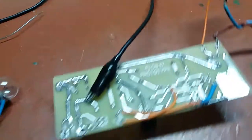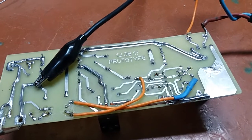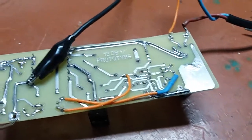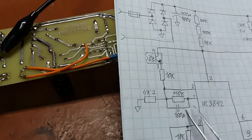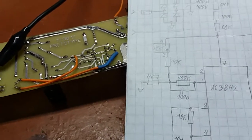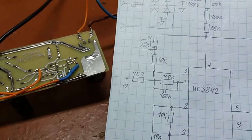What that means is that for my particular board, these values are not sufficient. I need to slow down the reaction of the error amplifier even more. I can do that by decreasing the value of the resistor or increasing the value of the capacitor. There is a sweet spot in these values and you need to find it. Unfortunately I don't have any formulas on hand, so this is just pure experimentation.